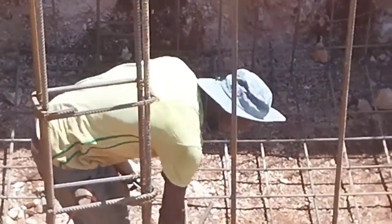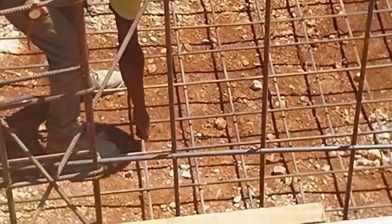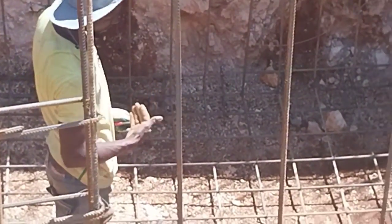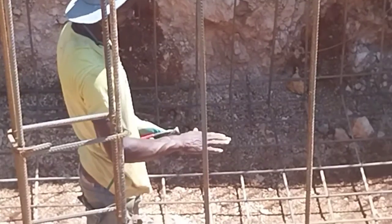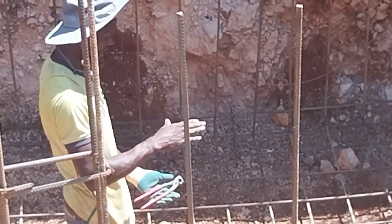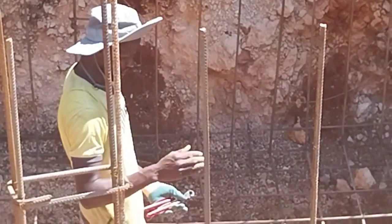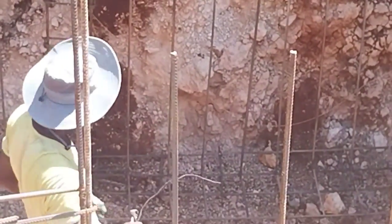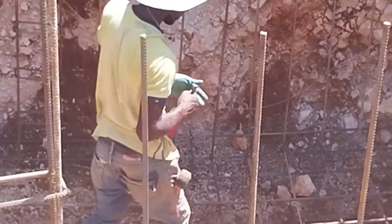As you see on the ground, we're going to put stone on it and catch it up so everything is off the ground. You can't have the concrete touching the ground directly — the steel must be in the center of the concrete. You don't want any steel on the ground here without concrete underneath it.